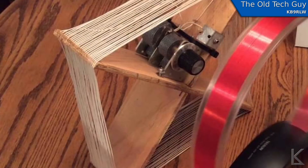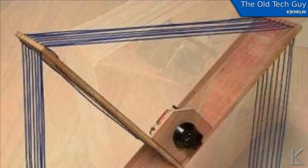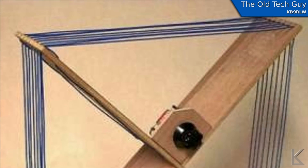If you have ever seen loop antennas for medium wave, the windings are always linear, organized, even, symmetrical, and nicely spaced. I think that is a very important factor if you're going to use it as a transmitting loop - it needs to be that way for it to couple up. So I'm going to rebuild the medium wave loop using a wood framework where I can wind the windings nice and orderly.